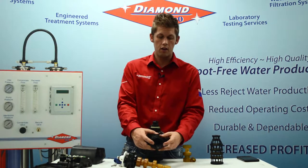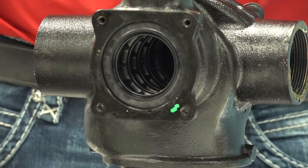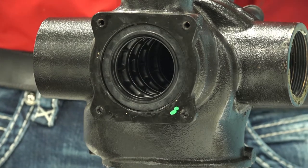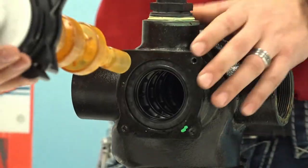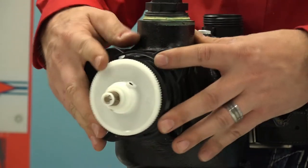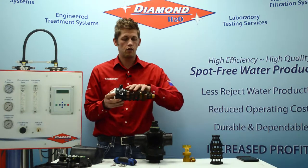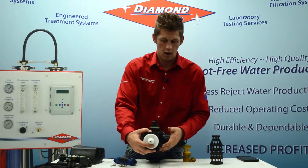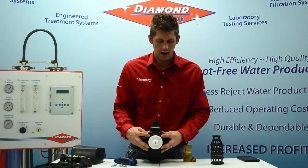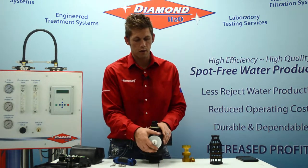To replace the stack, all you do is remove the old and insert the new — that's it. You're ready to reinsert your piston. To insert your piston, slide it in — very clean, very easy. One suggestion: lubrication is nice. Any O-rings that are of the black seal style, it's good practice to just make sure you have a small amount of silicone lubrication on them.